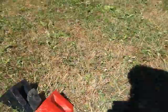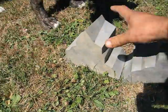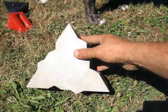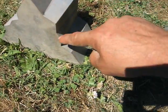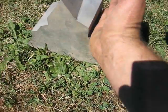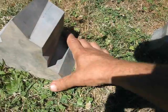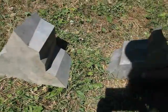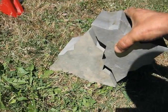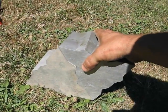And that's kind of a contradiction. So that led to this design here. This is a single inverse mirror plane, or a SIMP. On the abutting face, exactly halfway through, there's an imaginary plane which is an inverse mirror plane, so that what sticks out on this side is a recess on the other side. That allows the blocks to slide in without any undercut and they lock together, and that works pretty well.